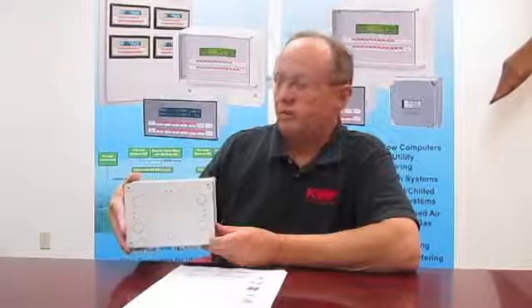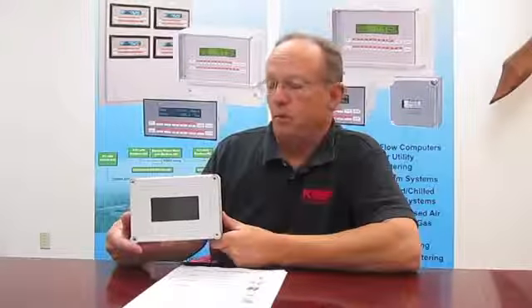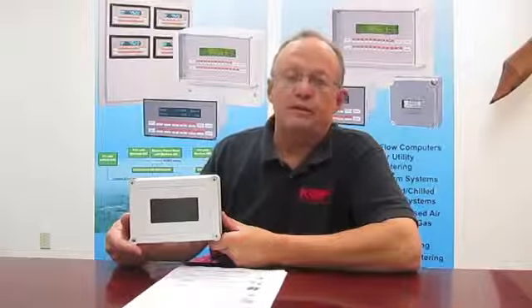The plastics on these can be modified quite easily with hole saws to provide conduit entries. It's important when selecting any enclosure that you decide how you want to run your electric and signal cables before making modifications to the box. Often these holes are added at the last minute, just prior to installation of the wiring.